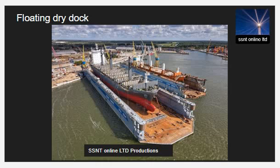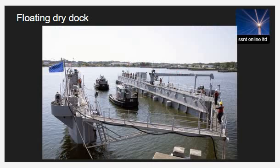The ship is brought near the channel, where the floating dry dock will partly submerge itself, and the ship slides inside the dock. Once the ship is in position, the floating dock is deballasted to drain the water from its hollow floors and walls, which support the vessel on the blocks arranged on the dock's floor. For leaving the floating dock, a valve is provided that can be opened to fill up the chambers with water and immerse the dock so that the ship can sail out.